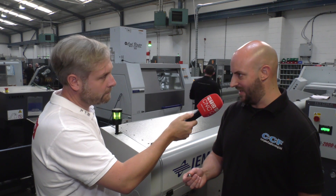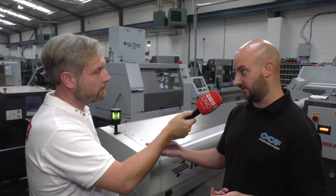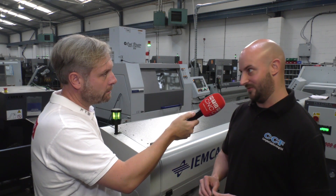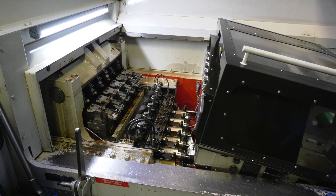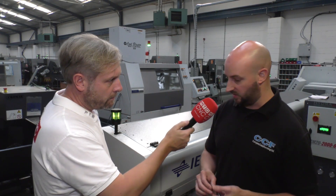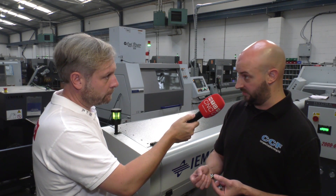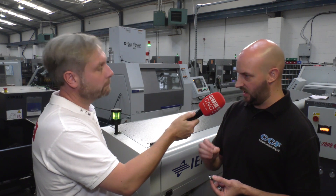With a McLaren engine comes higher performance requirements. With our normal valve train produced via cold forming methodology, we're making for 1.9 turbo diesels or 2 litre petrol engines. When it comes to a 4.8 or 5.5 V8 twin turbo, the requirements, stresses and strains on the component significantly rise. So you need tougher materials and more accuracy. Absolutely — what we're using is an EN24T, which is already a through-hardened bar. This then goes through an aerospace-grade heat treatment process — an epsilon layer — which gives the part high strength and integrity as well as good surface hardness.